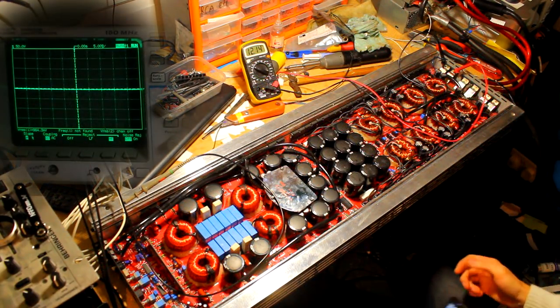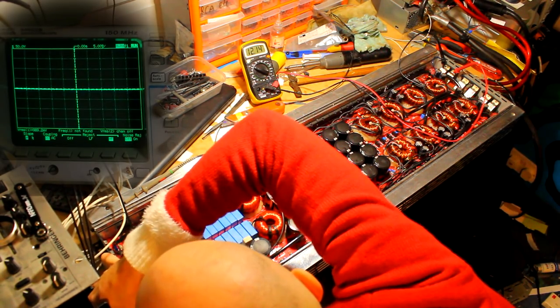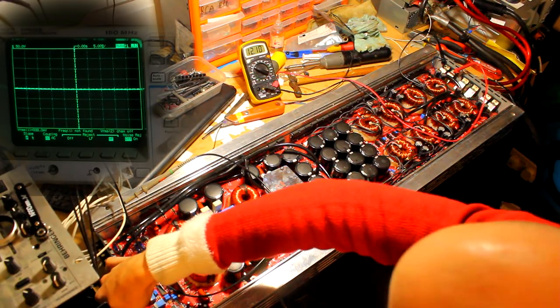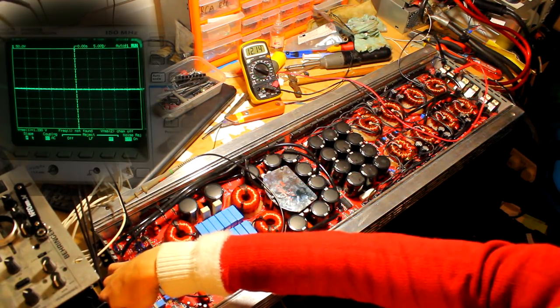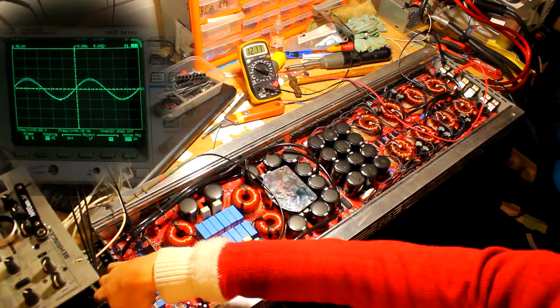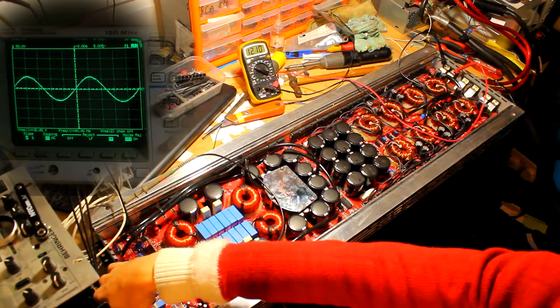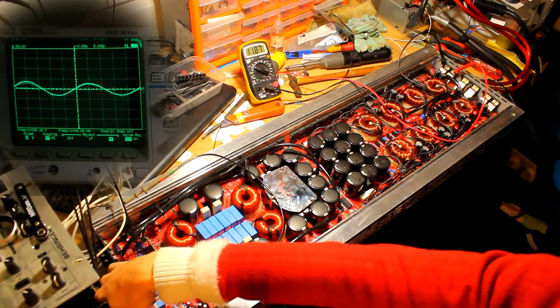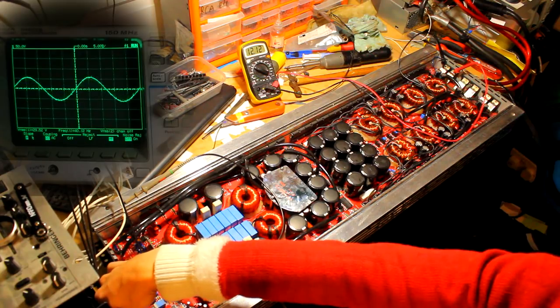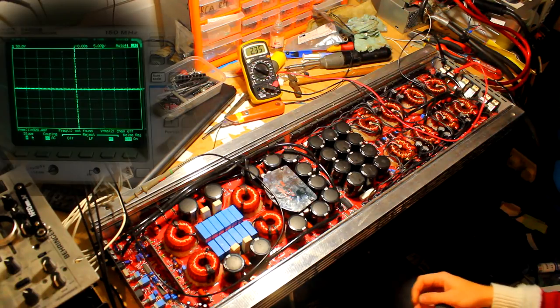Big supplies are turned on and we've got the remote on the foot pedal, so let's just turn the gain down and hit the remote, get this thing fired up. Okay, she's on, and let's hit a tone. I'm just going to monitor the input voltage as well, so it doesn't drop too low below 11.8. It's going to give her some power, just going to pulse it here. 11.8, 11.7 there on the input, so yeah, 40 volts, probably clamping about 3.5, 4k here. Okay, so the supplies don't like that much power. So yeah, we reached the limit of the supplies there.